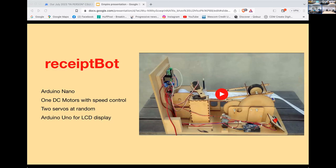Oh, I see. Is that two wheels or just one? Well, there's a rubber wheel on top and then there's another wheel underneath it, on the other side of the paper, so it's pinching the paper. You can't guide it with a single strip. And those two wheels, their alignment has to be dead on. If it ever breaks, take your time. Get a micrometer and measure that stuff out, and then run the paper for a distance and see how you did.